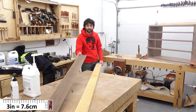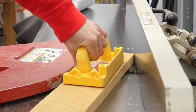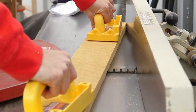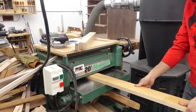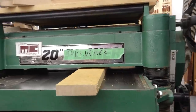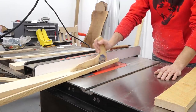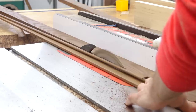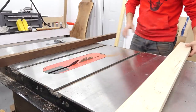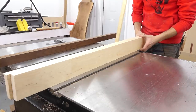This is going to be like a wider type frame, about three inches wide, and the other will be more like an inch and a half. I'm going to chop the birch down to rough length, joint, plane, and get it all milled up into nice stock. We'll rip the thermally modified ash into a pair of strips and that'll give us our stock to start cutting all the frame parts.